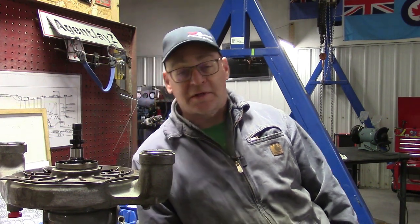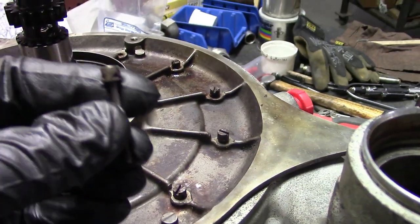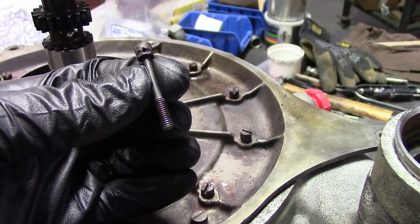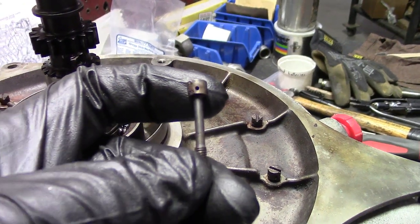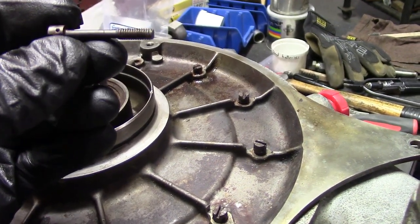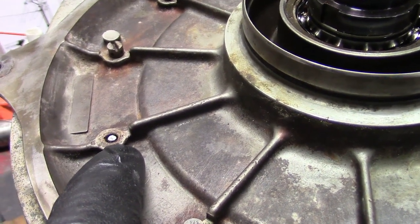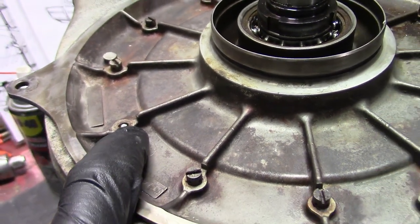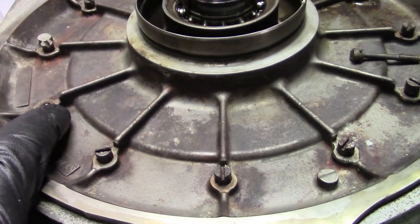Here's one screw that's been removed. Half of them were quite cheerful - they came out with about 50 inch pounds, which seems like a lot. You can see the head right by the lock wire holes - that's corrosion. This is a very strong little bolt, because 50-60 inch pounds is punching above its weight for this size. That's typical for an aircraft fastener. But there's one that after a great deal of massaging, careful coaxing, hammering, penetrating oil, and everything - it broke.